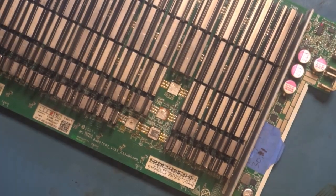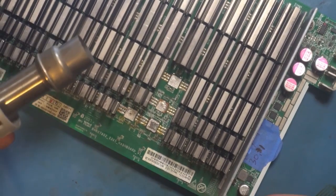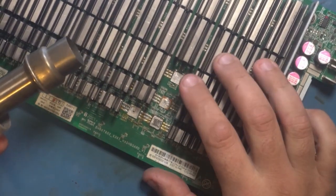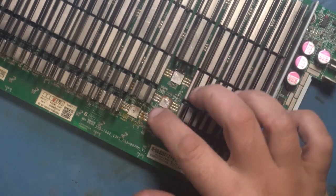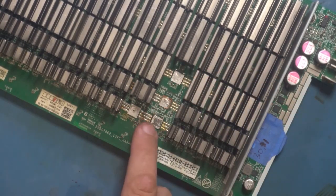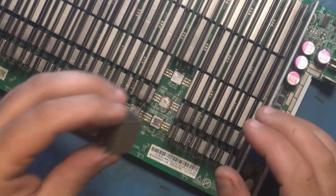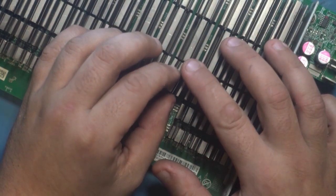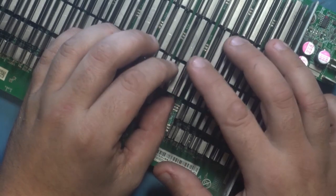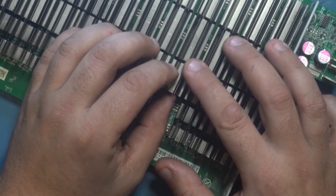For temperature on my air station I use 340 degrees and about 60% air. In the case of a chip that's really nice and flat — like this one right here, or really all the chips I have here except for the one with the spike — the board is cold right now, so I can just position the heatsink as good as I can, really take my time, and line it up.